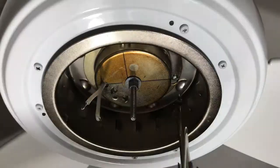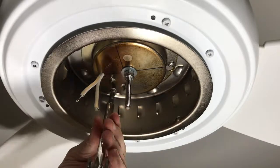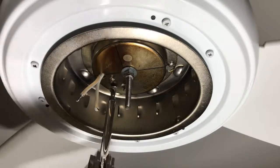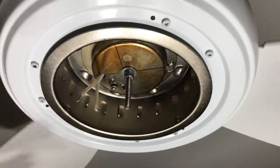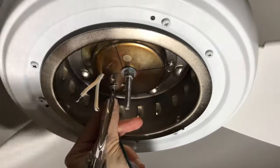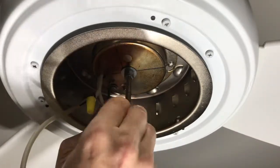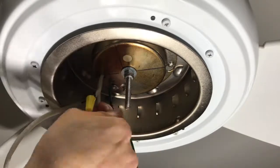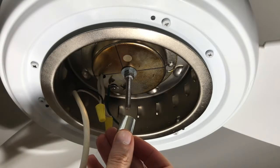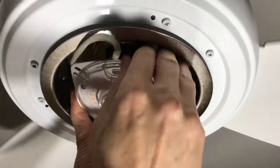I tighten the three screws. This is the screw that originally attached the light bulb socket to the mounting plate. I added a washer and now I'm screwing it back in, leaving enough space above the washer for the ground wire. This is the green ground wire — I removed enough insulation to make the exposed length fit easily under the washer. Then I connect the other two wires using wire nuts, black to black and white to white. I'm using the steel spacer to position the LED module about one inch below the mounting plate. First comes the spacer, then the LED module, then a washer and finally the lock nut.